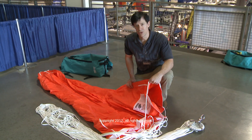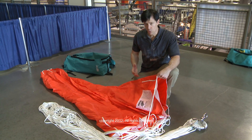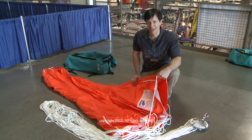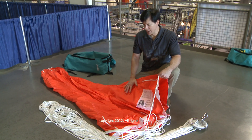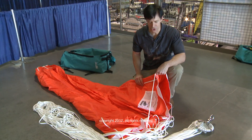This is a 16-foot diameter Fiorentino parachute sea anchor. When we determined what kind of fabric to use, I basically towed all kinds of stuff behind tugboats until they broke apart, until the chutes broke apart. The 8-ounce nylon turned out to be the best fabric for our particular parachute canopies, making it obviously very strong.